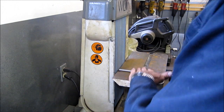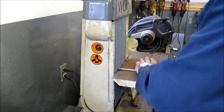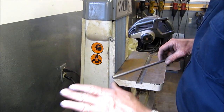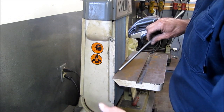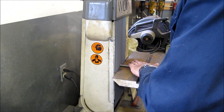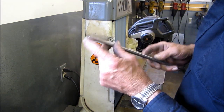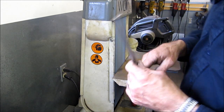Now I'm going to hold it down and roll it sideways, and that's going to do a kind of Blanchard grind on the end across that paper right there. Then I'm going to hold it up freehand, lightly, letting the paper roll the burr off the end. The same way I do a thread, if you cut off a thread and you want that burr to roll off the end, then your nuts will always start easily. So basically, just rolling it sideways, a nice flat grind right on the end. One turn lightly around like that just breaks that corner. That's simple.